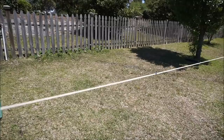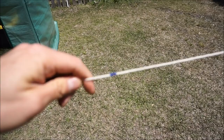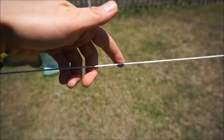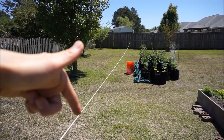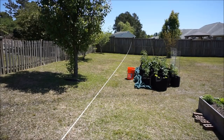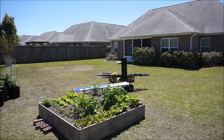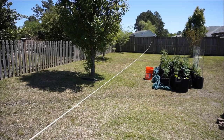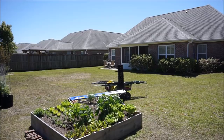I picked where I want my first post to go — this blue dot right here denotes where I'm going to put my first post. I'm going to drive the post into the center of the ground here, then take my tape measure and put a post every eight feet. The embedment depth will be 12 to 18 inches, giving me five and a half to six feet of post above grade at each location. I'm going to bolster the welded wire fence to the posts using zip ties. With seven posts spread eight feet apart, that gives me 48 feet of cover for the 50-foot length of welded wire fence — a one-foot overhang on each side.